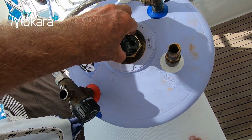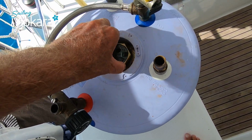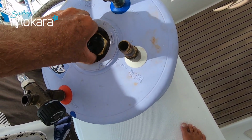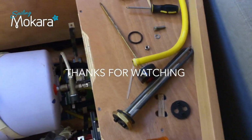Once the water starts flowing out of the tap, you can close the tap again and build up pressure within the system. Check for any leaks, and once that is done, turn on your power supply again. If you're draining down the coolant, refer to your engine owner's manual on how to do this. And then get the tank back into place.